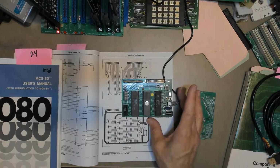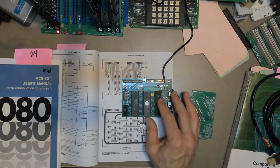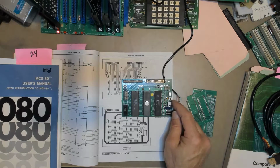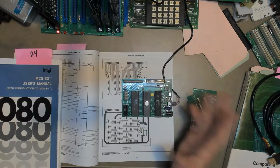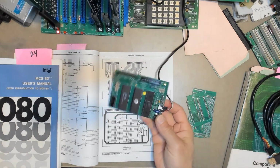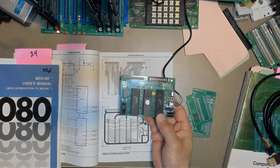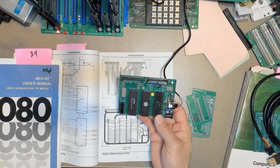Now, I was in college at the time, so that summer break, when I first saw this, I wire wrapped one of these systems along with a set of MC1488 and 1489 for the RS-232 drivers, and made a little 3-output linear power supply. And then I spent the entire summer just playing with this hardware, creating software and interfacing it to things. And, not to romanticize it too much, but since I was off to graduate school that fall and then starting a family and a career and so on, that was the last summer until I retired of pure, unadulterated freedom to do whatever I wanted to do. Me and this 8085 system, it was my version of the summer of love.